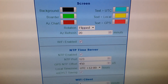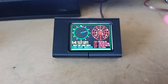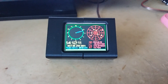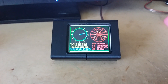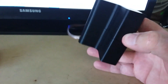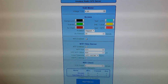The Wi-Fi enabled setting I've been having problems with. What I wanted to do was disable the Wi-Fi — so if I'm in a situation where I don't want to pollute the airways with 2.4 GHz Wi-Fi, or I'm running on battery and don't want the additional current drain, I can turn off Wi-Fi. Well, it turns it off, but the problem is I can't turn it back on because there's no reset button on the back of the ARGS. So that's something I have to figure out — I need to put a reset button on the back, because the settings screen is via Wi-Fi.